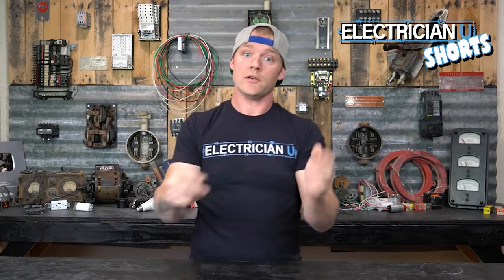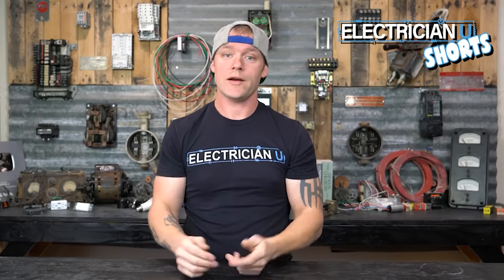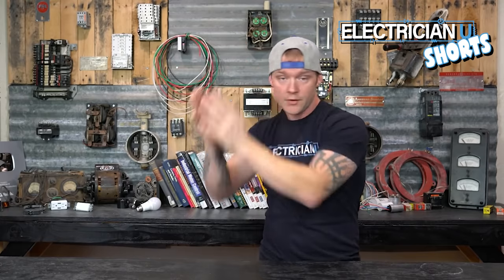Type 2 needs a breaker — you need to hook it up into a breaker so that if there's too much current going through that device, it'll trip the breaker. That's really the big distinction between the two. Both of them you're just going to put in your service panel to protect right where your service entrance conductors are and where your bonded neutral and grounding electrode are.